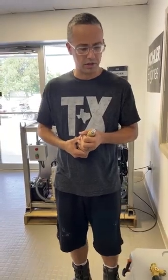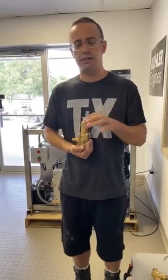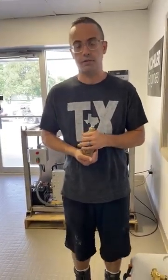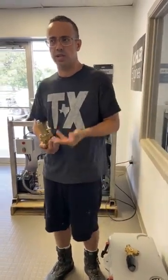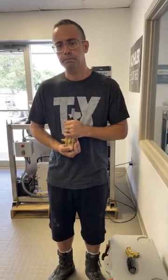I just keep it simple with the VRT3. I also don't like the way the VB350 fits on smaller pumps — they're heavier too. As for green spring unloaders, a lot of people like them, but I haven't seen a difference in flow or pressure in the field. Everyone says the half-inch inserts give you higher flow, but when you bucket test them at the same PSI the results are the same, so they don't clean faster. I mainly sold those for two-gun units, which is what they were designed for.